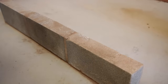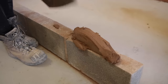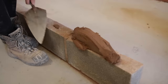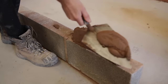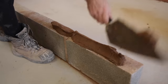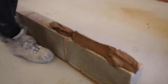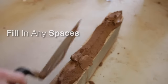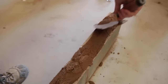It's at speed, so I'll just get a bit of mortar and do that now. Once it's on your bricks or blocks, we're going to scoop with the right side — we want a nice mountain shape, like a Toblerone, at 45 degrees, like this. Scoop that and put it back down, then mirror it on the left-hand side. The idea is we want to cover all the material — in this case, blocks. So as we're looking down, we can see if there's a bit of block visible — just cut again, put that there, and we don't want any material to be seen. Keep it nice and uniform, nice and even, scraping off and putting it down.